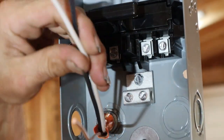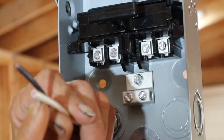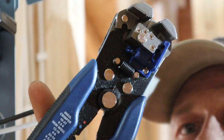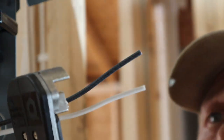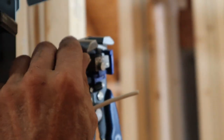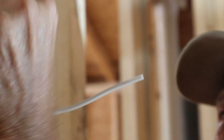So you've got three different lines in here. This is a 10-2 wire, which means it has two wires at 10-gauge, and the third one is the bare ground. What we're going to do is strip about a half inch off the black and the white. I have a pair of quick-strip pliers — you can also use standard ones. We'll take the black wire first and skin about a half inch off, then do the same with the white.